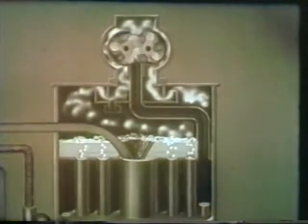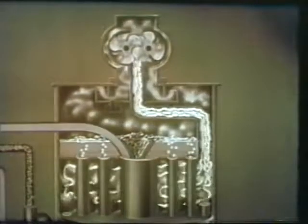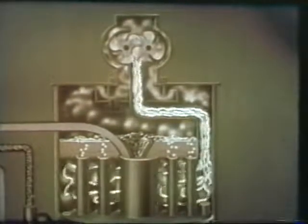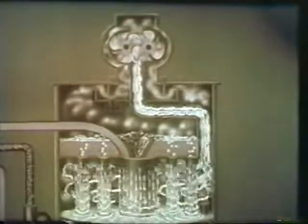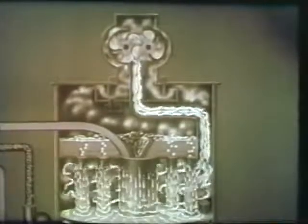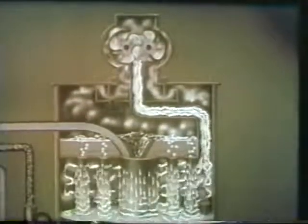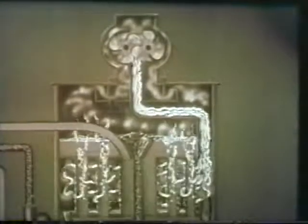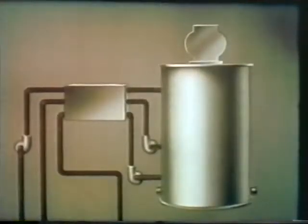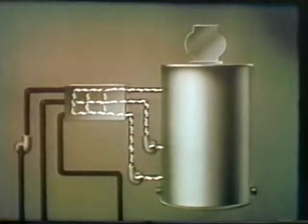In an operating unit, the hot vapor passes through the compressor. Compression generates additional heat. Condensation releases the heat that caused the vapor. There's also the heat acquired during compression and the heat acquired before the actual boiling started. Of the total heat, some transfers to seawater in the tubes. Some heat, carried off by the hot discharges, transfers to the seawater passing through the heat exchanger.